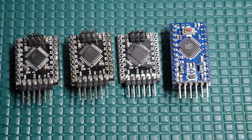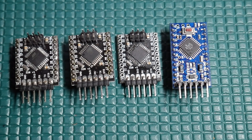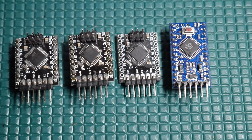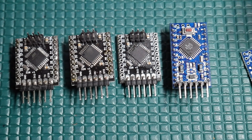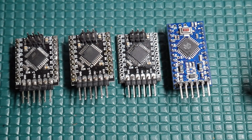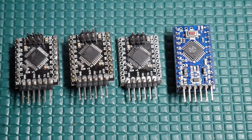You really have to strip it down and locate where all the current is. After some conversation with this guy, we find out that he's actually pretty knowledgeable about these things and had already removed those components, but still he was pulling over 100 microamps from this ATmega. So I asked him to send these boards over to me — just cheap boards from eBay. I loaded up some code on the ATmega and it was pulling pretty high.